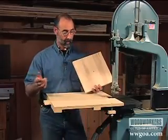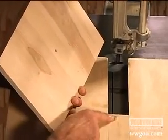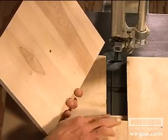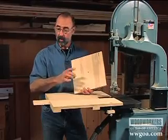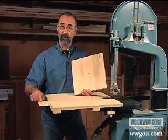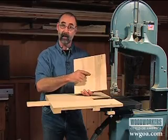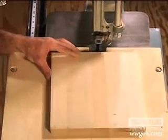In order to make a cut, I need to drill a hole in my piece that'll sit on that pivot point right there. So I've got a 1/4 inch hole, matches the 1/4 inch dowel. This is what I use when I do larger circles like this. On smaller diameter circles, on this end of the jig, I've just got a screw tip poking through, and you can rest small circles on that. But I find on bigger circles, it's better to use the 1/4 inch dowel and a 1/4 inch hole. It engages better, so they're not likely to jump off the circle cutter on you.